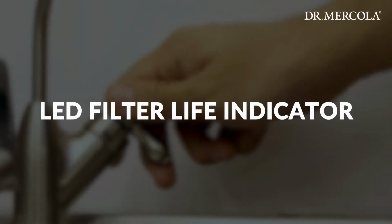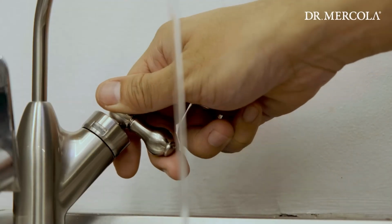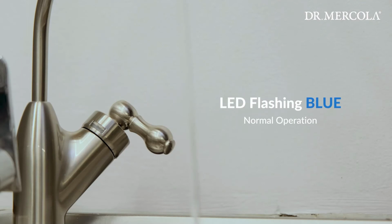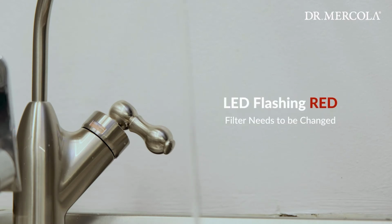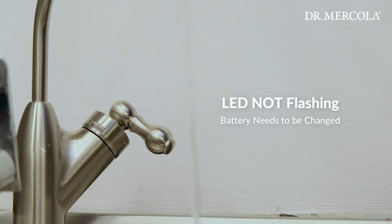LED filter life indicator. It is a good idea to change the battery when you replace the filter. LED flashing blue means it is on normal operation. LED flashing yellow means there is 25 gallons left until the filter expires. LED flashing red means the filter needs to be changed. LED not flashing means the battery needs to be changed.